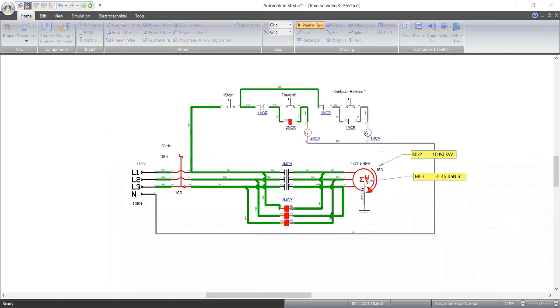So let's see what will happen. We're on 11 kilowatt, 11, 12. So let's go more down. We're on 12.7. Our motor still has some tolerance. Let's go maximum. Our breaker is supposed to trip now. It didn't trip. Probably I didn't set it. Okay, it has tripped. Our breaker has tripped. I told you that it can withstand a certain current for some seconds, and I think that also happened.